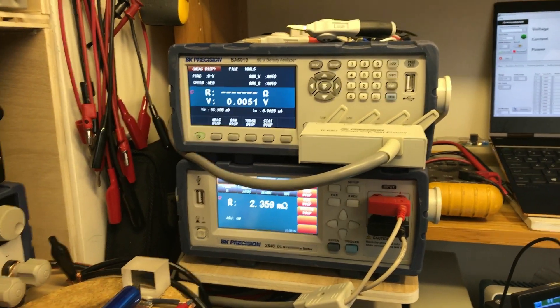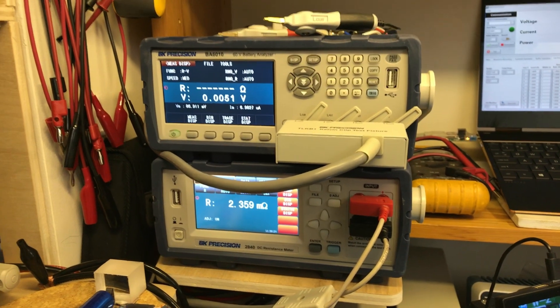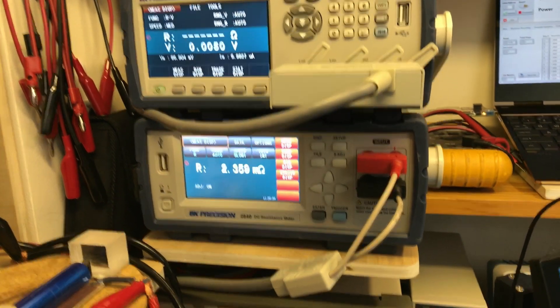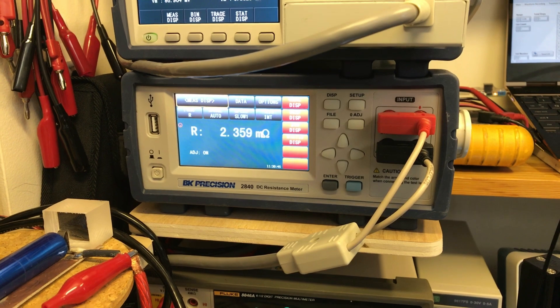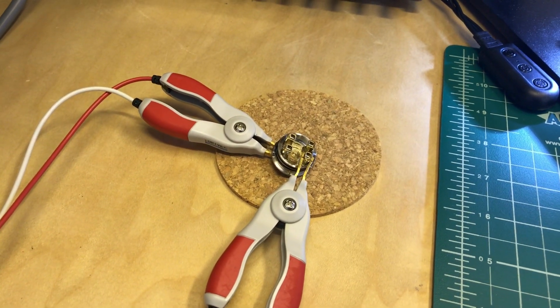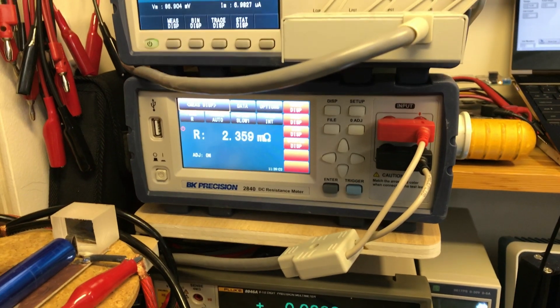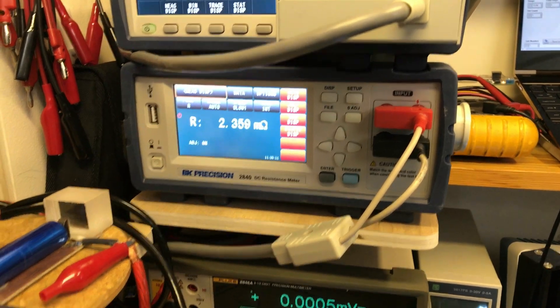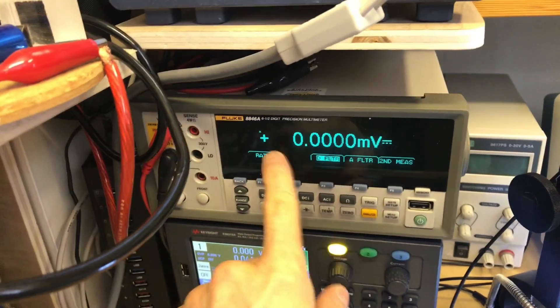This top one is a battery analyzer — it measures AC internal resistance, inductance, capacitance, and all kinds of things inside the battery. It's an invaluable tool for detecting whether one battery is the same as another. Down here is a micro-ohm meter — yes, millionths of an ohm. Right now it's reading 2.359 milliohms, which is 0.002 ohms, testing the resistance from the 510 threads up to the post and the resistance of the atomizer itself. It's used for mech mod voltage drop testing, contact resistance — almost anything.